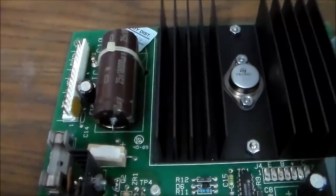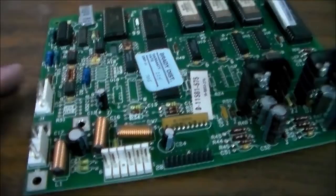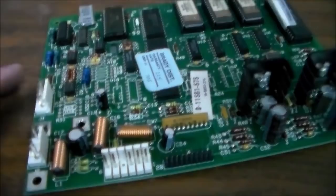I've pulled out the sound board that does the music and speech. The little tags all fell off the ROMs, so I took all the socketed chips out, cleaned them, and now I'm replacing the capacitors so it'll sound clean with as little distortion as possible. I'm also re-soldering the connectors like on everything else, and since it was already working that'll be about it for the sound board.